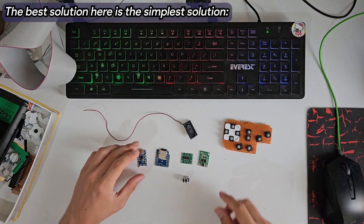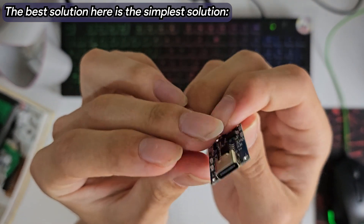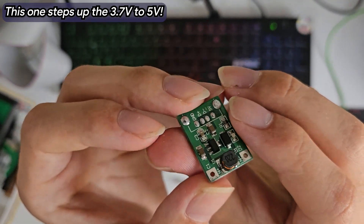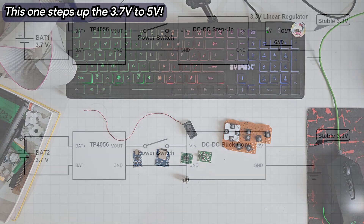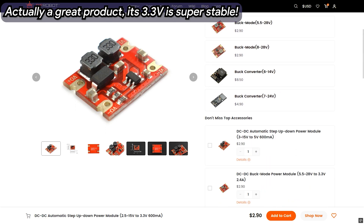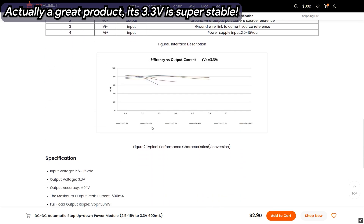For charging the battery and protection, a TP4056 module is more than enough. The newer models also have USB-C, which is a big upgrade from the older micro USB boards, and the 1A charging current is plenty for this application. For voltage regulation, I initially considered a step-up converter with a linear regulator for stable power, since the ESP32 is prone to current spikes when enabling Wi-Fi or copying large amounts of data. I later replaced this with a 3.3V buck voltage regulator from DF Robot, which works amazingly well and is far more efficient.